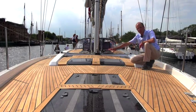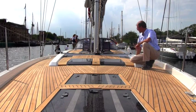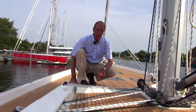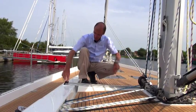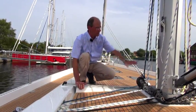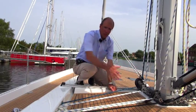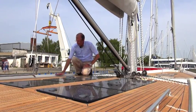Each of these hatches is rounded off at the front to create a nice look from the inside too and let people get a really good view of the outside. This is the new design, and these are really the only sections which are still obviously made of plastic. Here we have the fully integrated rail for the self-tacking jib. The angle is just right as it swings across — it's nice and flat as well as being integrated. The water runoff passes through here, so that's the self-tacking rail. The halyards all run straight into the diverting channel without touching the deck — five halyards on each side, all routed towards the back. The sun deck as a whole covers a large area.